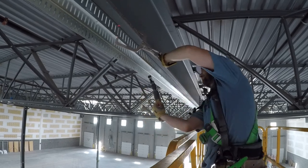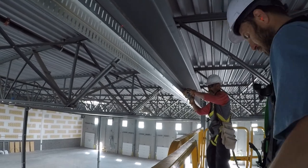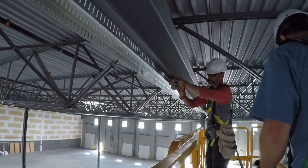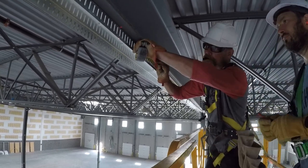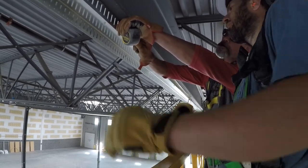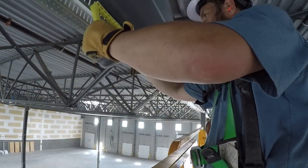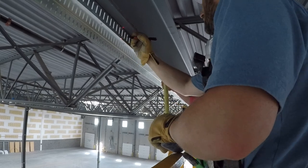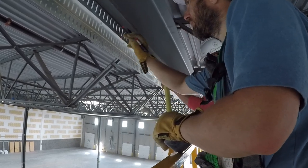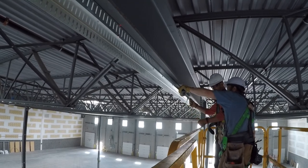You could also be lower on the lift. Aaron is much taller than I am. You can see he's already drawing the centers — it's simple. You just clip onto the last center you put and keep drawing your centers. Right here I can tell the center's off — something's wrong with it. I used the pin laser to check it. You don't need to plumb up every track as center; you can do one every 30 feet as a check in case something happened with the tape — and in this case it actually did. I went back and fixed the centers.